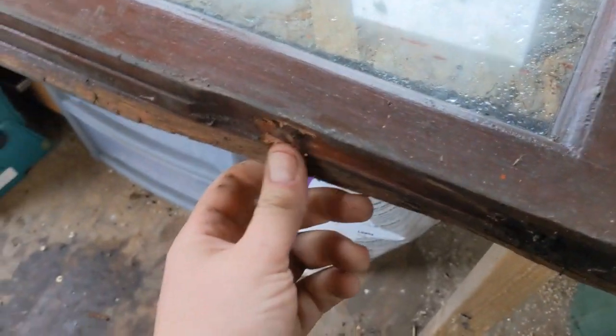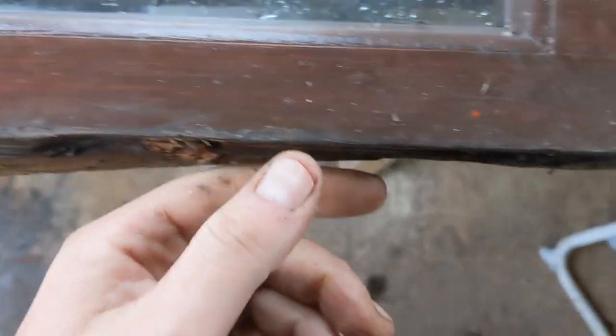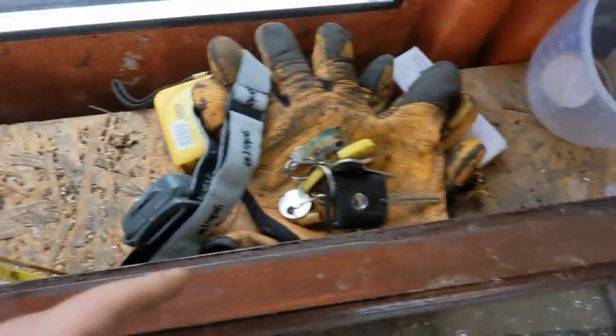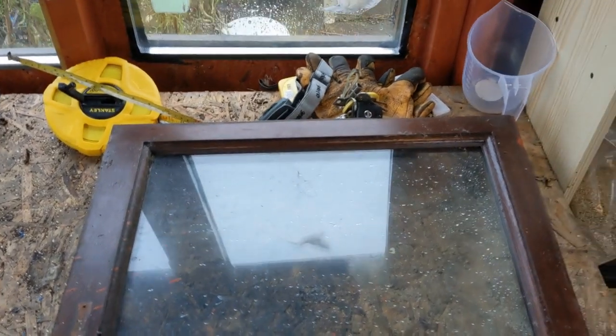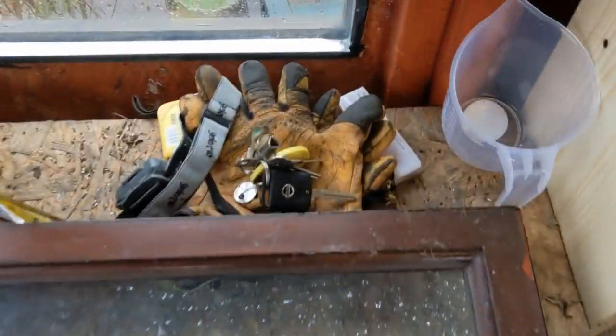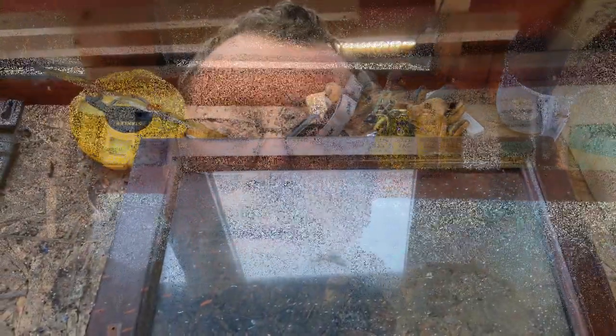Although looking at that, it's been gouged out, which is a pity. So I won't be using that edge — I'll use the opposite edge, take that off, straighten it up, and get the hinges on that. That's the next step: just flatten off one of those lips, and we'll do that right now.